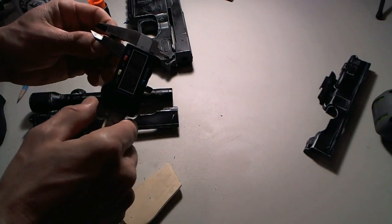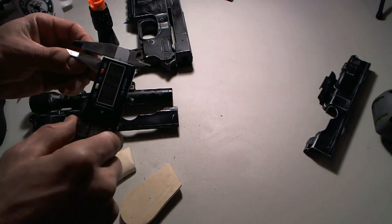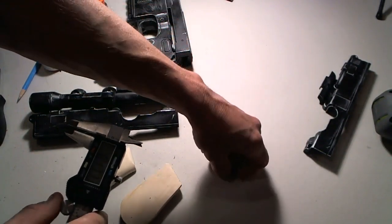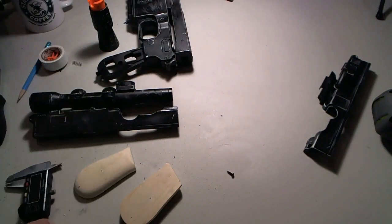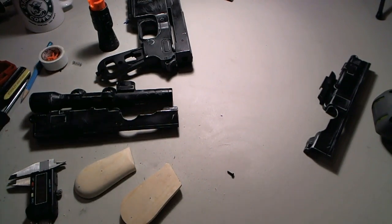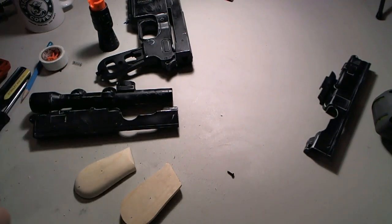Look at that, 0.160. Okay, so that's 2/8 there. Or correction, 1/6, a little bit less than that. So now I'm going to find, well, what I can do. The head of the screw is 1/6, so I can go through my drill bits and find. I can just test my calipers on here and find the size that I want. I know 0.13 is an 1/8 inch, so it's got to be a little bigger than that. Probably the next size up is 9/64. So 9/64 comes to 0.138. Okay, that's 0.138. Going back to the head of the screw, that is 0.167.